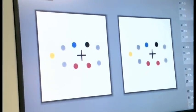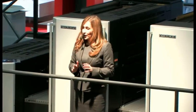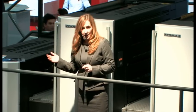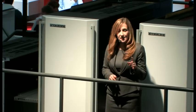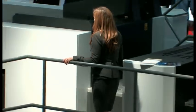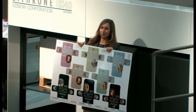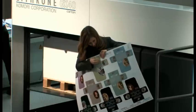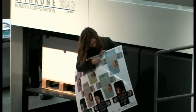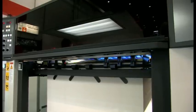We're going to begin production printing — scheduled to print about 200 sheets in this part of our demonstration. If you look at the PQAS quality inspection screen, you can see the printing stability at high speed with the GX40, Komori's specialised machine for carton production. The theme is a package for masquerade masks — a package design featuring dazzling parts. Again, I'm going to scratch my fingernails on it: completely dry with one power-saving HUV lamp. If anyone else would like to check, please do.